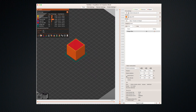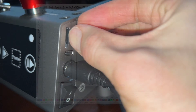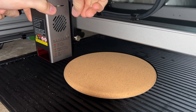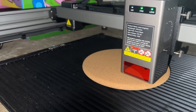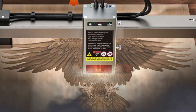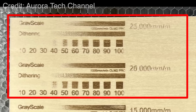Laser cutters and 3D printers both take G-code as the input for their operation. 3D printer G-code is generated by its slicer; laser cutter G-code is generated by its own dedicated software. The process is simple: import an image in SVG format, configure the settings, then export the G-code to an SD card or connect directly to your computer. Before running the job, it's important to ensure your workpiece is positioned appropriately within the cutting area. You'll also need to adjust the height of the laser head so the workpiece coincides with the focal point of the laser. A convenient feature called Frame allows you to perform a dry run, in which the laser traces out the outline of your design without actually cutting. When you're ready to cut, hit run and the laser will turn on and start engraving or cutting. If the material is ever ignited by the laser, a fire detection system will kill the power. When working with new materials, it's advised to print a test pattern to determine which combination of settings will yield the desired darkness of engraving or depth of cut.